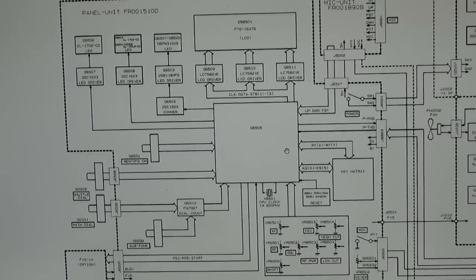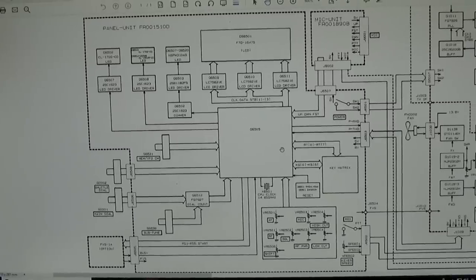And here, this is the portion of our front panel processor, right? And what you can easily see, for instance, what I've told you, here's our AF, which is our volume control. And you see, of course, this is a normal potentiometer, but it only takes the value of the DC, which is here at the middle pin of the pot, and that will be converted to digital information.